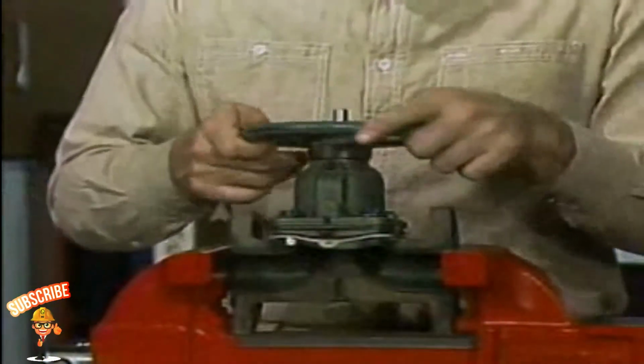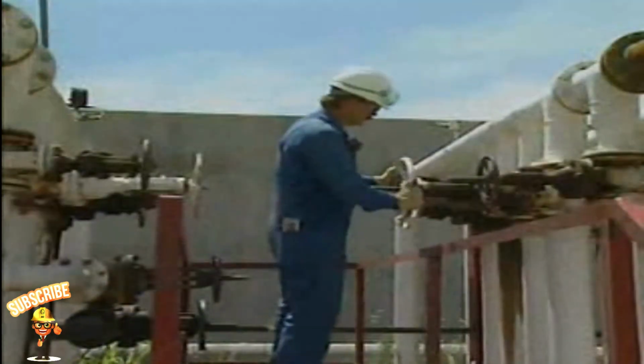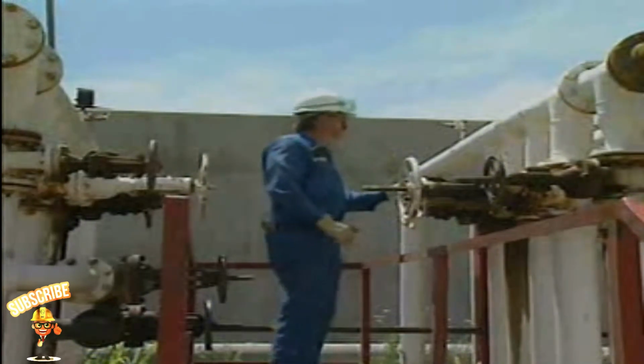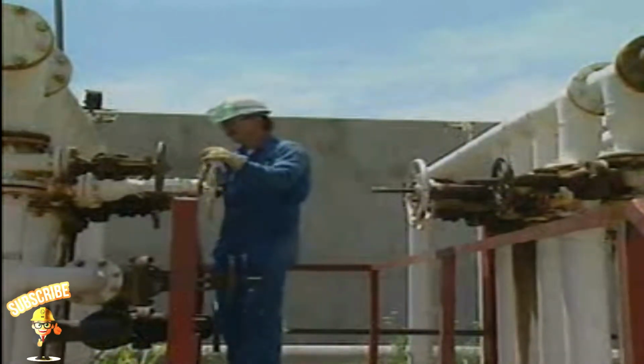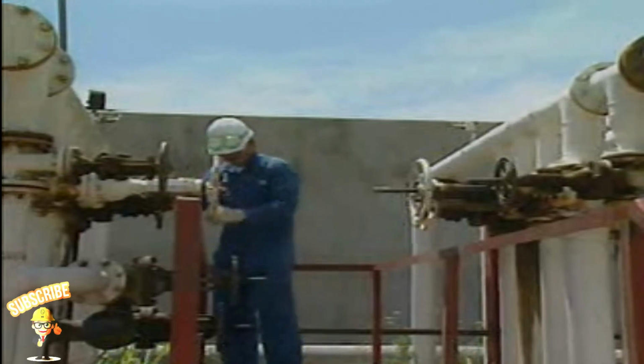When a hand wheel is used to operate a diaphragm valve, excessive force could cause the diaphragm to jam into the seat and be cut, resulting in leakage. Finally, to check if a manually operated valve is closed, try turning the hand wheel or handle in the proper direction to close the valve. This prevents undesired flow through the valve if it's already tightly closed.